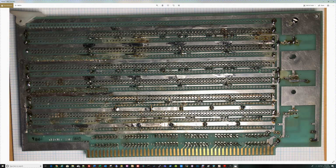I really can't say. I've still got to work the -9 volt regulator into here. I've got an LM7908 on order. That's a -8 volt regulator. And we'll be adding a couple of resistors to push its ground pin basically up a volt to get it to -9, or actually I should say down a volt. So really, there's where we are.